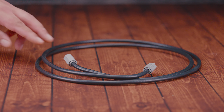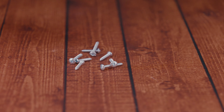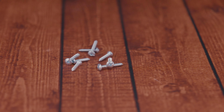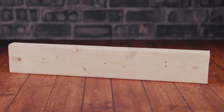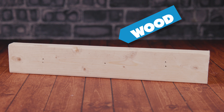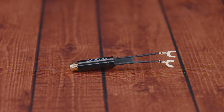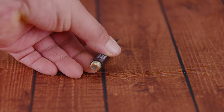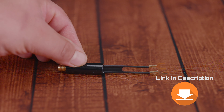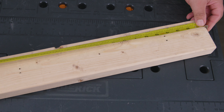Next you're gonna need a coaxial cable — the length depends on how far from the antenna your TV will be. We're gonna need a minimum of 10 screws, and depending on the head size of your screws you might need some washers. Next we're gonna need a piece of wood; in this case we're using a 2x4, about 20 inches — the longer the better. Finally we're gonna need a matching transformer, which you can get for around three dollars, link in the description.